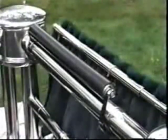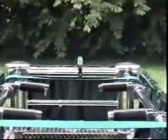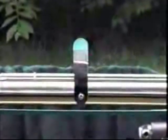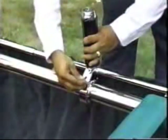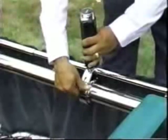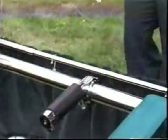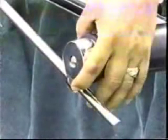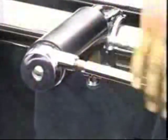The clamp also has a ratchet-pawl mechanism that must move freely and not be bound up. The end roller is used to guide the casket over the front end of the device and up onto the placer arms. The end stop is designed to prevent the casket from rolling off the back end. Both the end roller and end stop are attached to the device at the factory so that no assembly is required. To attach the placer arms, the lock screw on the placer clamp must first be loosened to allow the clamp to open. The clamp is then brought around the ratchet gear on the side rail and locked in place by re-tightening the lock screw. The rods are attached to the placer arms by inserting the back end through the hole on the end bushing of the first pair and threading the front end into the end bushing of the second pair.